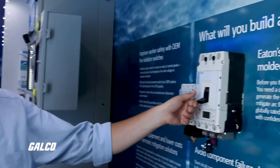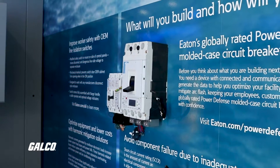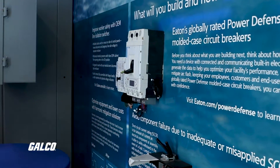This isn't an active demo, but it highlights a new product for us — this is our Power Defense breaker. It's a new breaker we're launching pretty much as we speak. What this breaker does is new for us in that it has a high degree of diagnostics you can pull out of it. With this breaker I can monitor current — how many amps I'm drawing, how many times the breaker has been turned on and off, when the last time it was turned on and off, why it tripped, and how big the fault was. It gives you a ton of information. You can put it on a network like DeviceNet, Profibus, or Ethernet to get all that data.